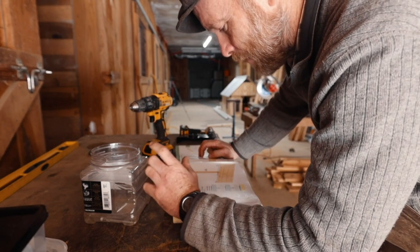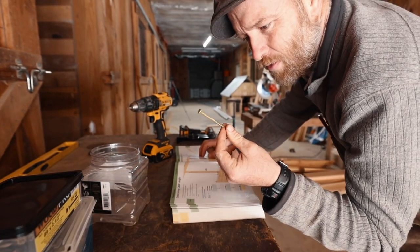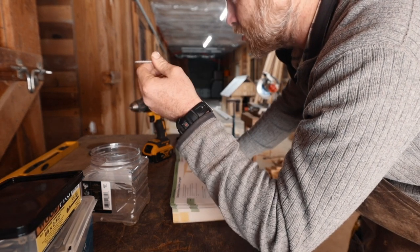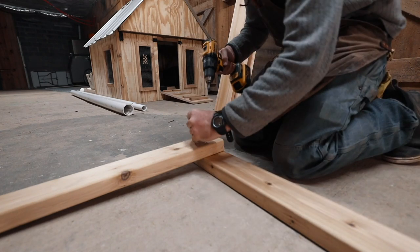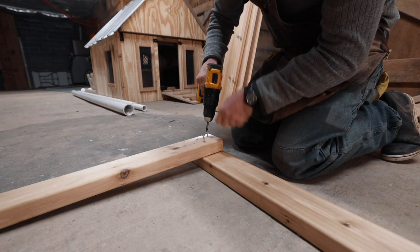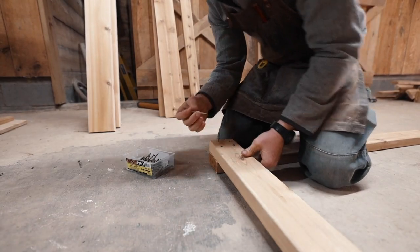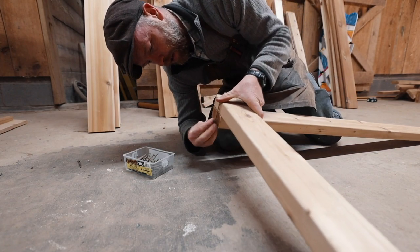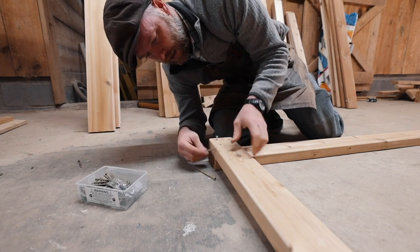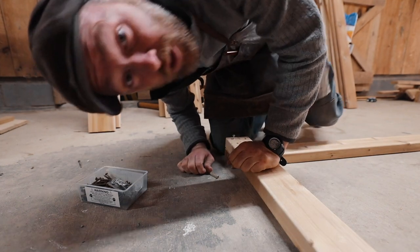Because Joel uses actual size lumber and we're using store-bought, it's slightly smaller. That means I didn't account for that when I bought the screws — you don't need a four-inch screw to go through two two-by-fours because it'll stick way out. I had some three-inch ones left but they were stripping. Tried a bigger head bit. Then I found some two-and-a-half inch ones — look at that, that's probably perfect. Proceed with the two-and-a-halves.